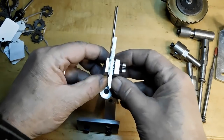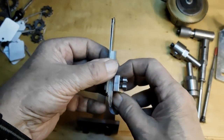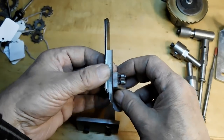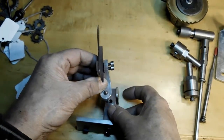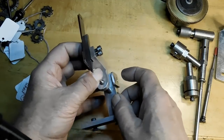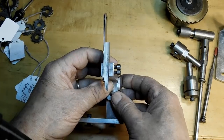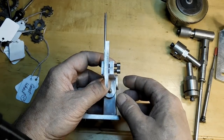I've offset it — you can see it's been offset with a feeler gauge to a predetermined distance from Porter's book. Now we fit it in here and we'll take it downstairs, put it on the Sherline lathe, and grind our radius.